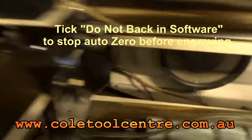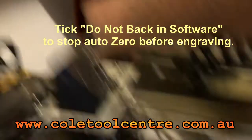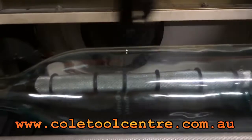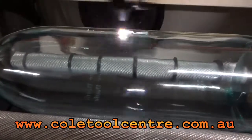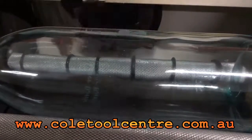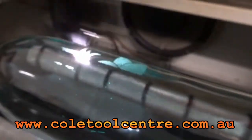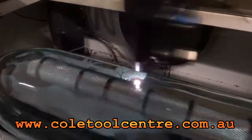The roller's going round and round — it's found zero on the X-axis. Now if I release that, it's going to try and engrave wherever I release it, so I'm just going to try and get it okay. Now the biggest thing with glass is the slippage. This is going to get a frosty look about it, and it looks like it's turning okay. But if it's slipping, you'll get the width to be wrong — you might get lines or be doubling up in the same position. So the main thing with glass is to get it so it doesn't slip. It's looking pretty good already — that's a very nice frosty finish at 30% power. I'm pretty happy with that; that's going to work well. I'll let it run and then record when it's finished to show you the outcome.